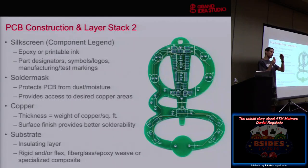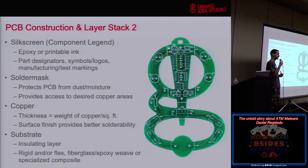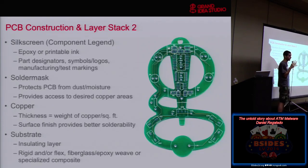There are a bunch of other layers as well — along with copper and the substrate. Starting from the top: the silkscreen layer usually contains component information, part designators, things the manufacturer or engineer might want on there, pin-out notations for connectors. On this board there are part designators that uniquely identify each part, and test points — which are usually put on interesting signals that an engineer, manufacturing facility, or programming facility needs to access. If you're looking at a board, you want to look at the test points first, because engineers will only put them on things they need.